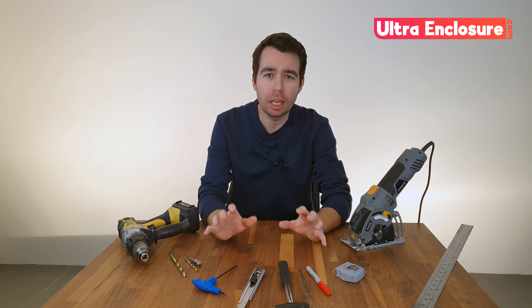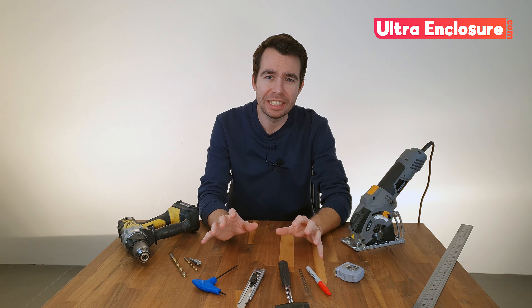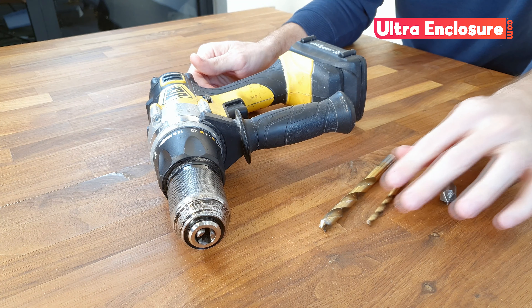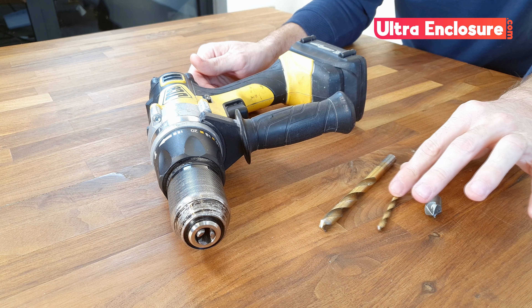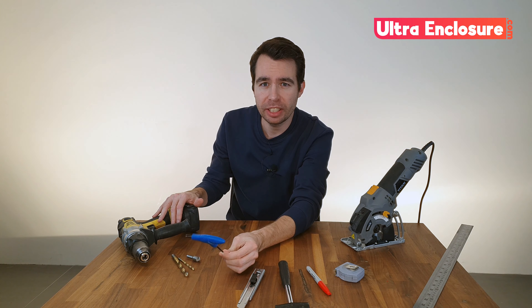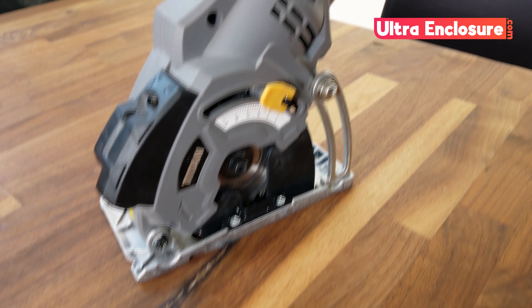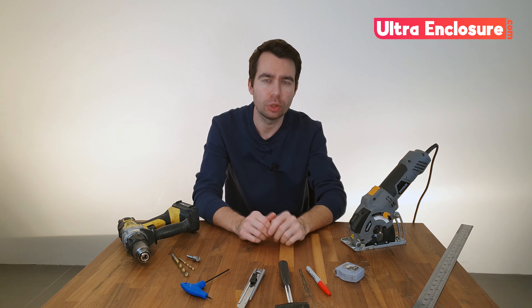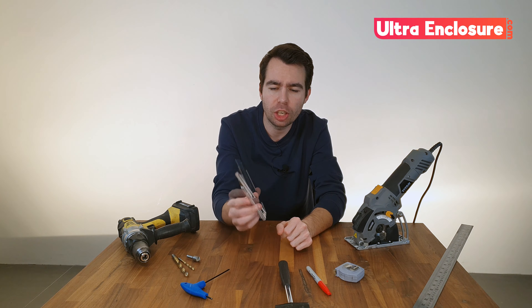Within the kit files you'll find a range of cutting and drilling templates. Make sure you print these at a scale of 100% and they'll make many of the tasks later on a lot easier. Finally before we begin, I'm just going to summarise the tools that you'll need. I have a drill with a 5 millimetre bit, a 10 millimetre bit and a countersink bit, an M5 hex key or allen wrench. If you're cutting your own acrylic you'll need a saw — in my case I'm using a mini plunge saw. You could also use a jigsaw or another tool of your choice, a good quality sharp knife for cutting the foam, a mallet for the shelving, and a marker pen, tape measure and a long straight edge.